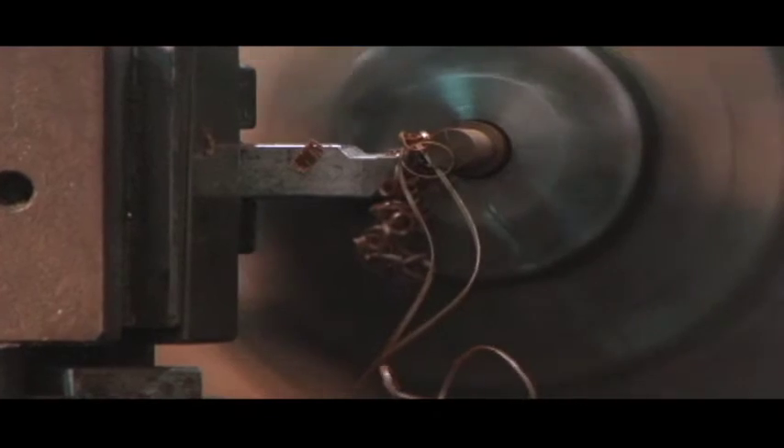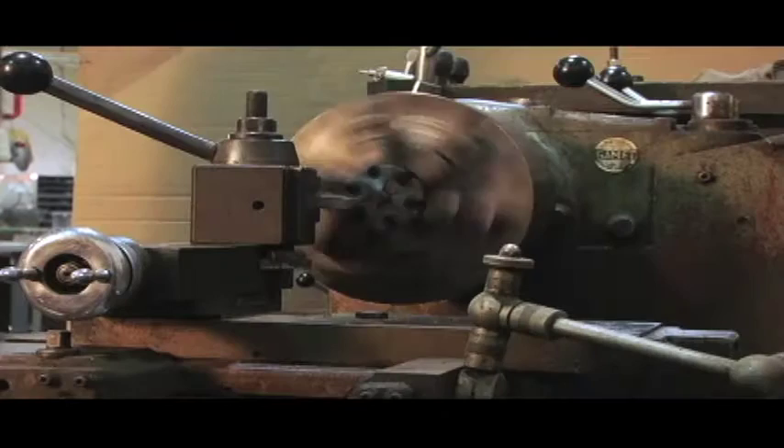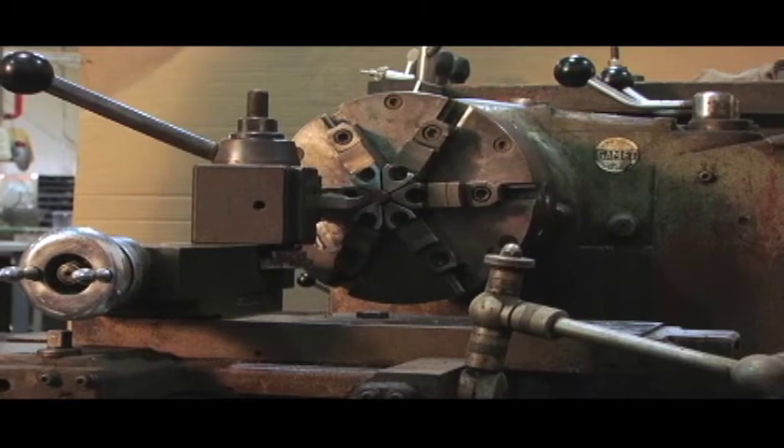Plastics can deform if held too tightly, so the first question is how to hold it. The two most reliable methods are an OD or ID collet. The other option is a 6-jaw type chuck, which will distribute pressure evenly. To turn DuPont Vespel, simply use a standard lathe with chucker or screw machining techniques.